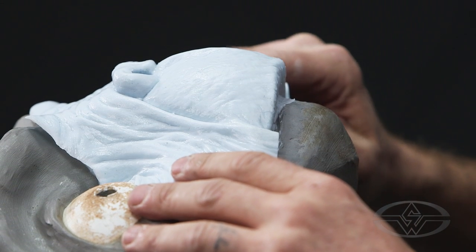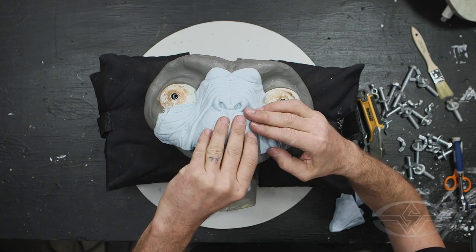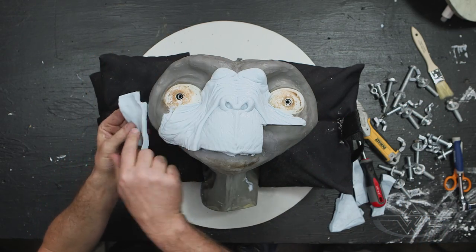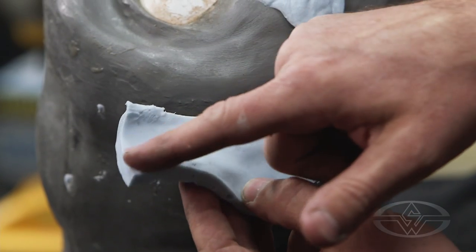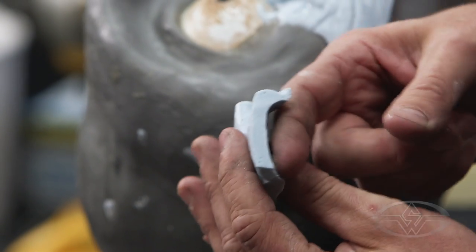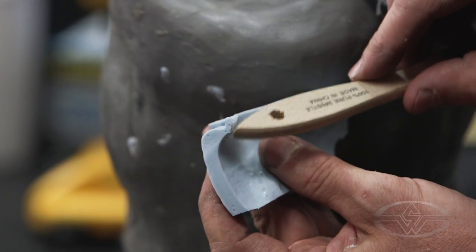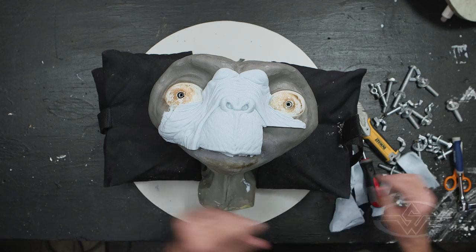Now we'll see how our upper lip is. It's hard to see on here, but as I can see in the sheen, this has a little bit more porous surface. I can see a little bit of a lap line where we did our Propoxy buildup right here. We have eliminated that thick area — before it was like this thick — but we added our Propoxy and now we have a nice, almost quarter-inch thickness, just like the rest of the skin. And that's exactly what Bud wanted. So far, so good.